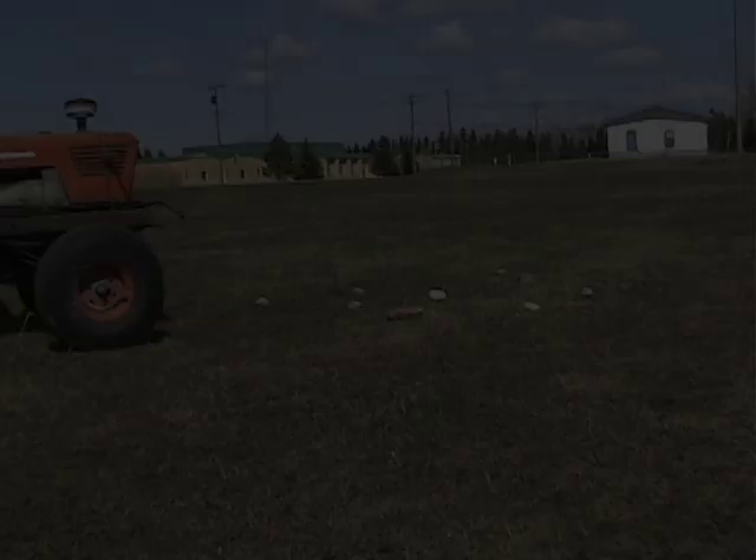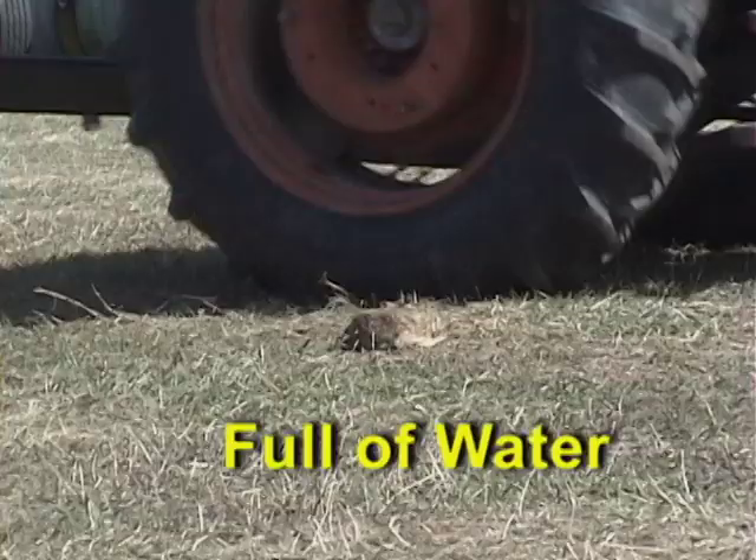If you're trying to punch down rocks in old pasture or hay fields, watertight drums are a useful factory option. When they are completely filled, an additional 550 pounds per foot makes sure the junk is sunk. With optional equipment, some models can be transported loaded.